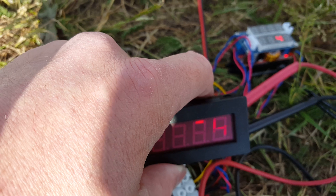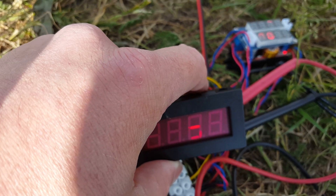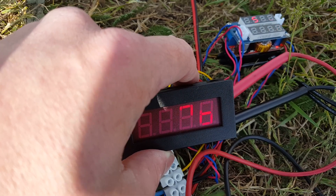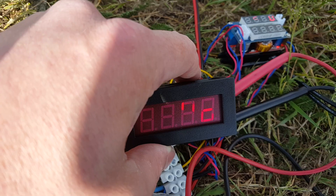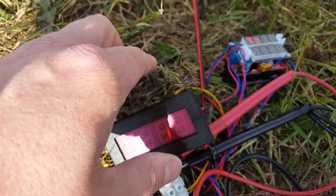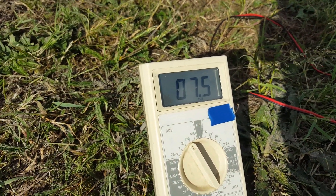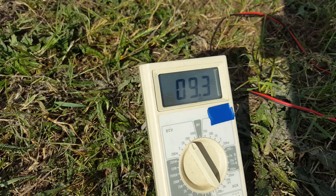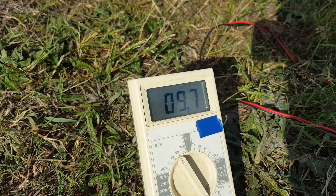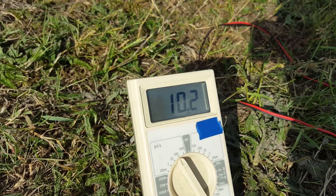Which is reasonable. But somewhere from around 100 to over 150 RPM is where it really starts to do something. This stepper motor probably isn't the right choice — I might even need something like a NEMA 23 instead of a NEMA 17. Do note, these stepper motors are rated for 12-volt operation, which means you get a decent voltage from very little RPM. That's one of the reasons I chose stepper motors — they produce reasonable voltages for the system with just a little bit of RPM.